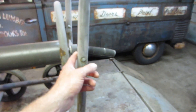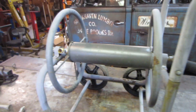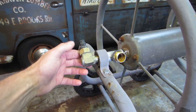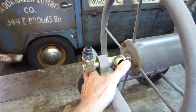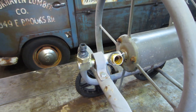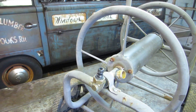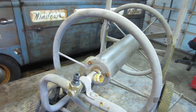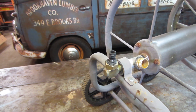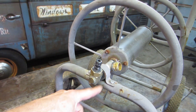It got a little beat up — the handle's bent and hitting the body, but we can fix that. The coupler is generally the most common fail point. I put my thumb over it, blew into there, and you can feel air leaking somewhere in between. So I think we'll take a minute, take it apart, see if we can cure that and use it to replace the one that's crapped out. Let's get it on the stand and see if we can find a burned-up o-ring.